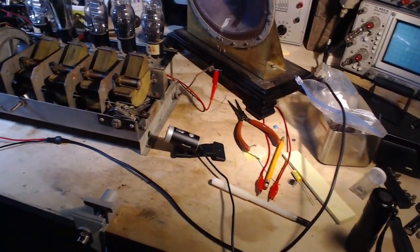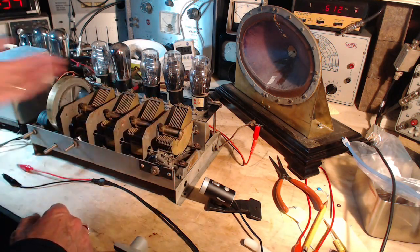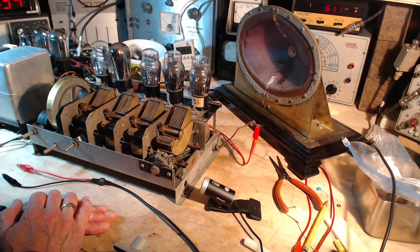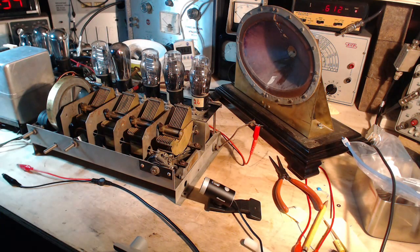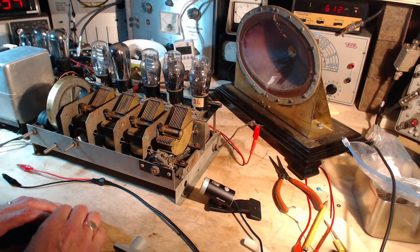The most they can do, I think, is affect the strength of the radio. I can turn this down now. It can affect the overall strength of the reception, and also introduce or null out squeals, feedback, weird sounds like that. We're not getting any of that right now. I think when you have the radio performing at its best, you're on the verge of going into some kind of oscillation. Under this condition, the radio becomes super sensitive and will receive weak signals better. So when I eventually get around to those, I'll be bringing the performance up to the point where it's almost squealing.